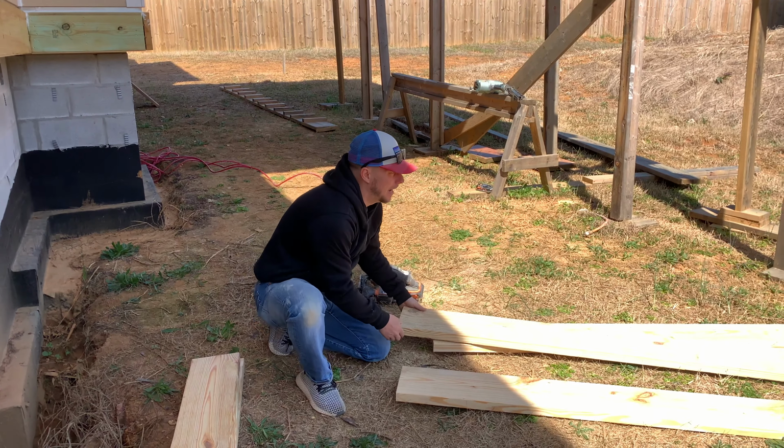All right, we just made a few short sticks of kindling here. Okay, so now we're gonna take these 3 pieces of wood. We're gonna look down, see which way they're crowned. That means which way they're curved. Put them all the same way. We want for that crown to be up, bowed up. That way it will sag down into place over time.